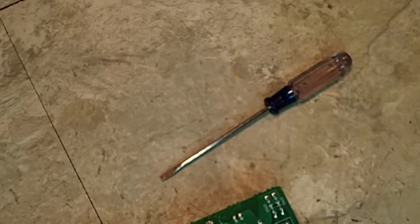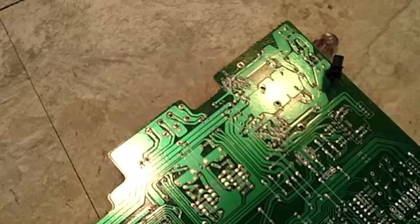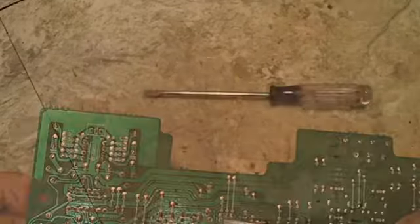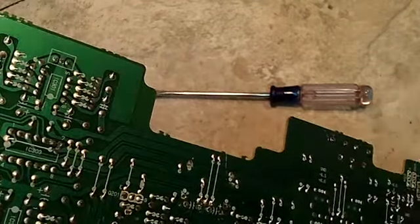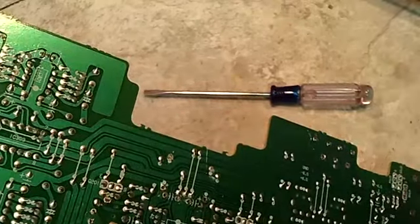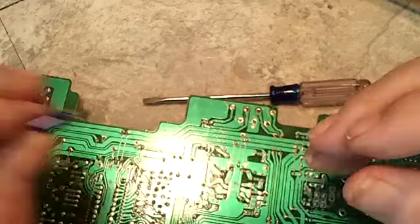Let's try it one more time - this would be an easy one. That thing has got a different sound when you actually get it to suck up something. I have noticed that right away - it definitely has a different sound to it. I got one leg of it loose. It probably has got a little solder on it. Yep, that is what it was - a little solder. Is this the same value? Yep, 22uF at 10V. Alright, there are four components.